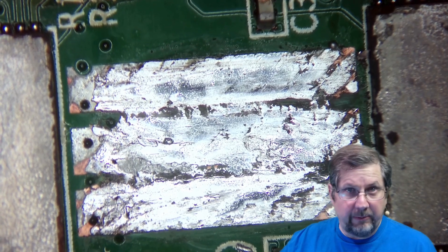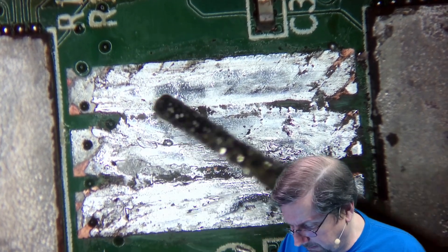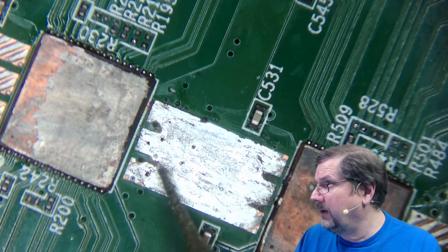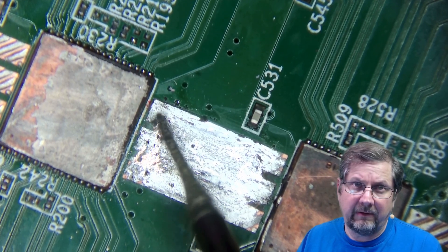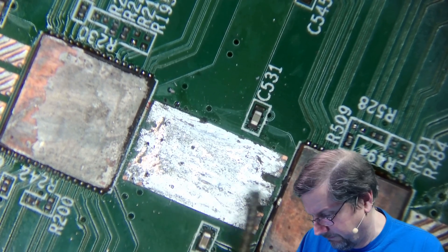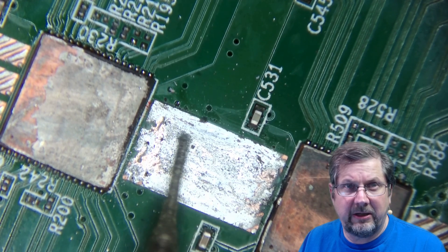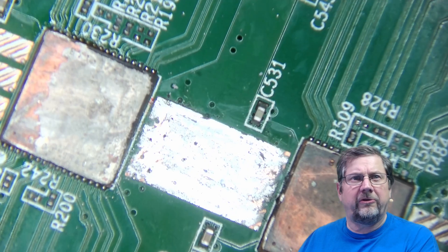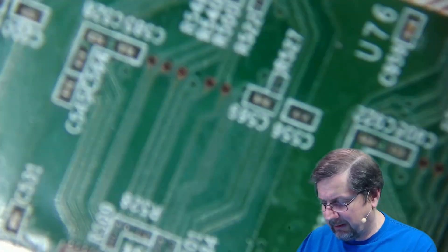Here's one that I had previously done on a previous repair — the nut fell off — and as you can see it's mostly cleaned off. But a better example — this would be a much better example of what I'm talking about. I want to get rid of this little bit right here. I don't want any solder mask left where the nut is going to touch. I'm just going to sit there and grind it. Be careful — you don't want to dig too deep because you are getting into the copper. We're going to put solder back across there, which will strengthen it and give it more current-carrying capacity, but still don't go deeper than you absolutely have to.